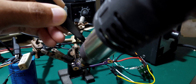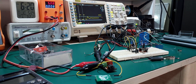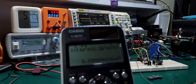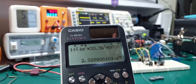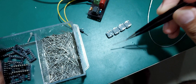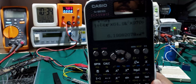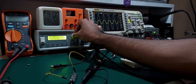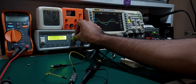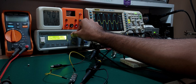Triggering on the very last switching cycle shows how the drain rings right down to zero volts, enabling ZVS. With that out of the way, it's time to start work on the modification — the DA2034 is to be replaced by the mod board. I checked the inductance using a relic from 2017 and the values were way off; the individual inductors are within spec, so something is wrong with the PCB itself. After some arts-and-crafts rewiring, the result shows the expected primary and secondary inductances. I was able to verify the 1:4 turns ratio using my function generator, though only at a particular frequency due to the self-resonant frequency of this assembly.